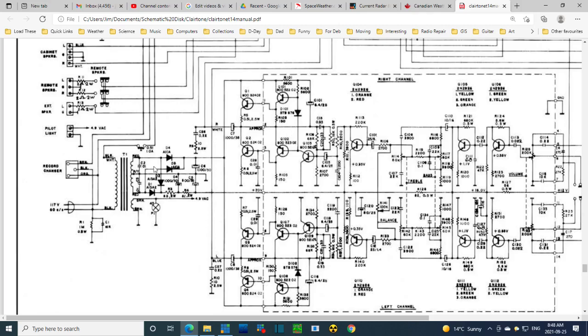If we follow the other diodes and filters, there's two capacitors, there's a bit of a pi filter network here. It doesn't exist up here. This is 1,000, the same as this one. And then there's an additional one that looks like 500 here, 500 microfarads. So you have a better, more filtered power line here.